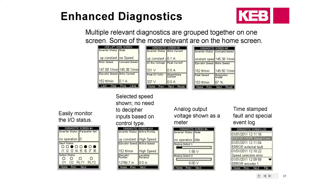The dots on screen four light up — filled in — when an input is active, regardless of whether you're using NPN or PNP type inputs. A highlighted circle means the input is active, not necessarily that there's 24 volts there, just that the input is active. For output status we've got two digital outputs and two relays on the control card — these highlight when active, meaning the condition has been met. If the output is highlighted but you're not getting voltage, it could be a different problem, but at least you know the drive is seeing everything correctly.